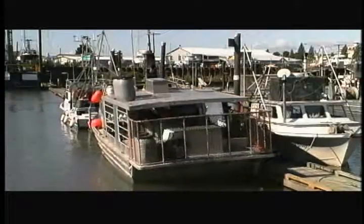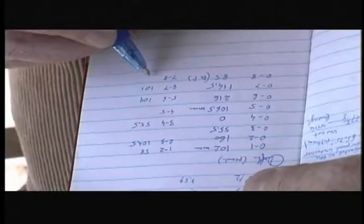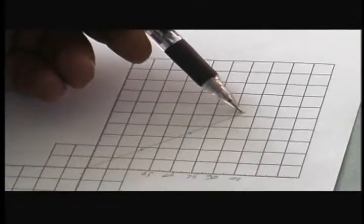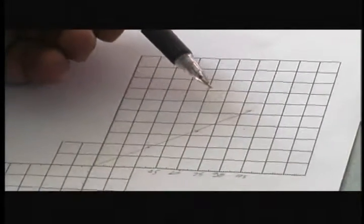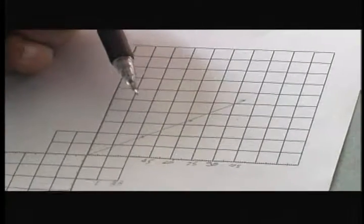Transport Canada requires eight weight movements. We went through the full eight shifts, marking pendulum deflections for each shift. By calculation we looked at whether it was a good inclining experiment — this provides a straight-line graph. If it's not a straight-line graph, it's not a good experiment. If the data points lie right on the line, it would be perfect.